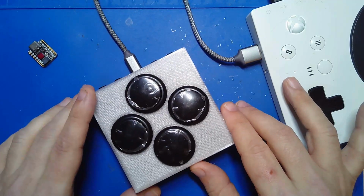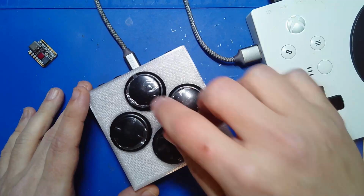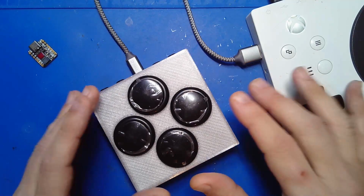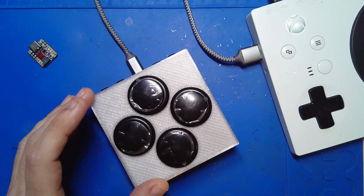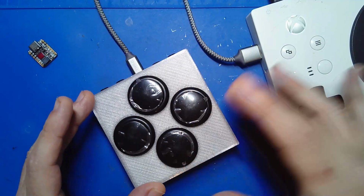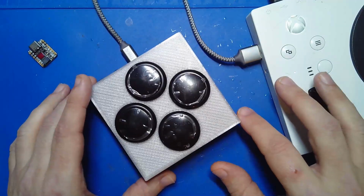There were two sources of inspiration for this. First off, the Warfighter Engaged folks with their Quad Ds, which are a series of digital buttons that use 3.5 millimeter cables to the back of the Xbox controller. I really like that concept because I've had some users who don't want joysticks, they want to use buttons. I also took a look at the work that Barry Ellis has done on his One Switch site, which is a device that allows 4 different switches to connect to a converter box, which then goes into the Xbox's USB port. So the three minds working together has resulted in this device.